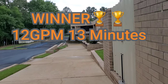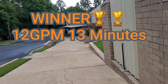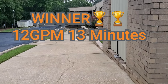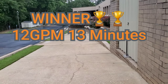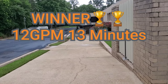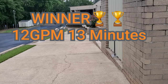The 12 is great on commercial properties. The 12 is not as great on residential where the water flow may not be as heavy. If I don't have heavy water flow coming from that spigot, it's not going to keep up with the 12. It's not about the PSI — guys think, 'I'm going to get 4,000 PSI,' but it's not about PSI in pressure washing. Anybody who knows about pressure washing knows it's all about the gallons per minute and having that direct correlation between the two.